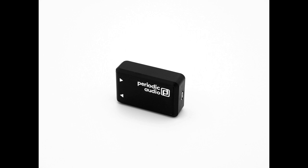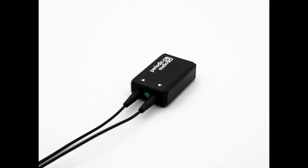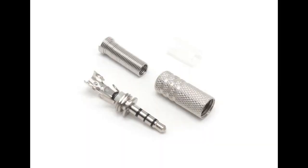Next, the user interface — there really isn't one. It's an amplifier with twin high-retention-force 3.5mm jacks. You plug your cell phone into the input jack, plug in headphones into the other, and it turns itself on. Unplug either and it turns itself off. Those jacks are TRRS designs, meaning they'll pass through a microphone signal if your headphone is so equipped.